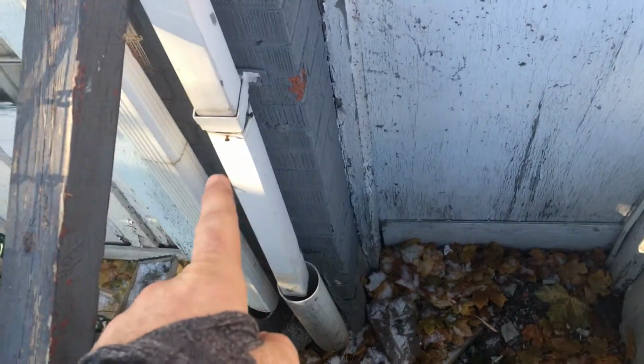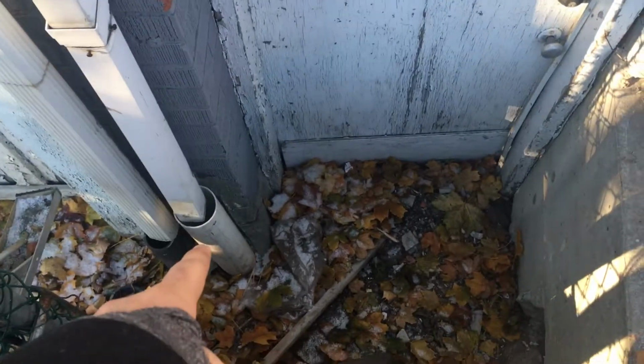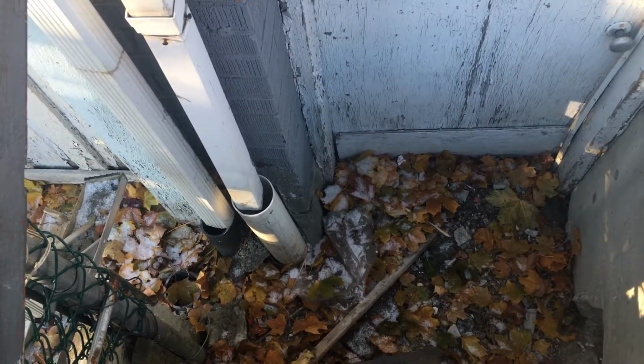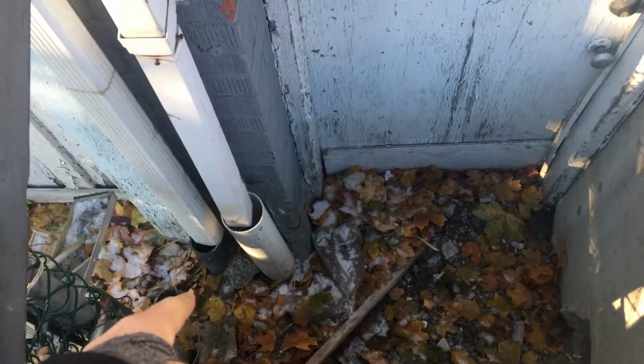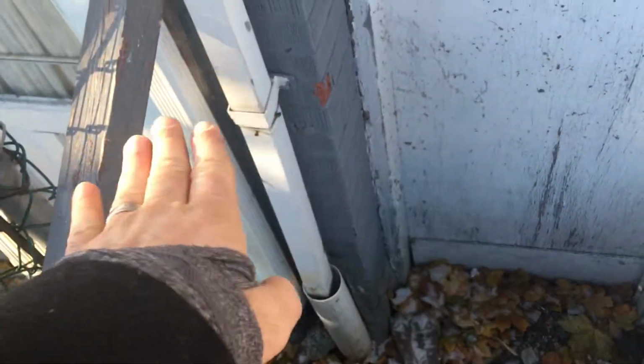My thought is, as I'm standing here looking at it, by the way, we have to disconnect this and we have to have the downpipe spill out onto grade. You're not allowed to bring rainwater down into the sewage pipes anymore because the city's been having issues with backing up pipes in heavy rainstorms. All the rainwater goes down there, it backs up the pipes, and people get flooding in their basements through the drain lines. So we have to have this cut off above grade and put a diversion pipe spilling out onto grade. That's number one. So we can't use that pipe to absorb the water that's going to percolate through here when we backfill.